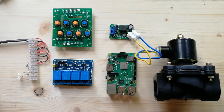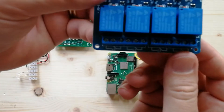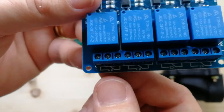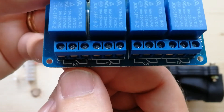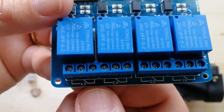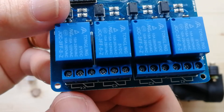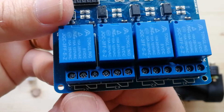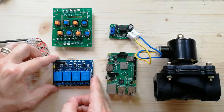Here for example I have a 12-volt DC 5-amp power supply — and that's it, with this one we can manage the valves. You can also use a 24-volt power supply and 24-volt valves with no issue; just use the relay as a switch. To clarify how to use it: each relay has three contacts — the center contact is the common connector, the right side is normally closed, and the left side is normally open. When current is applied, the switch closes the circuit between the common and the left connector, and this is what we use for the valve.